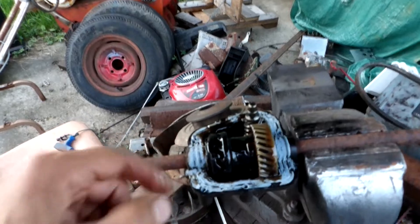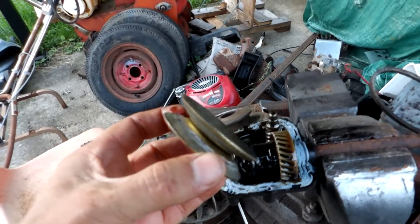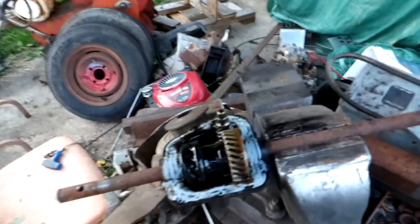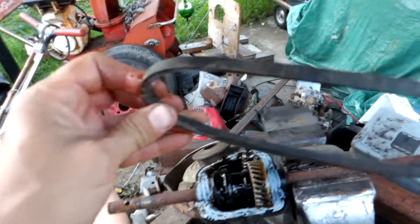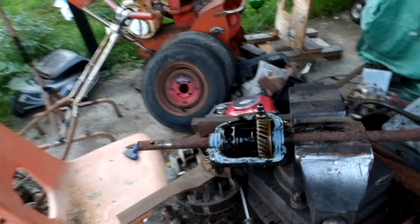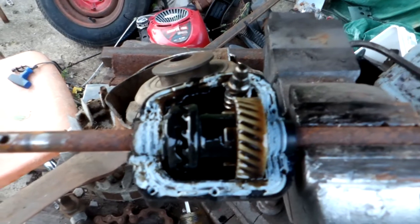Since I can't tangle with anything inside the gearbox, I'll have to get a larger pulley on it so that it'll turn slower — which will probably result in a longer V-belt. But nothing's ever easy, right? Anyway, that's the magic that happens inside these little transmissions.